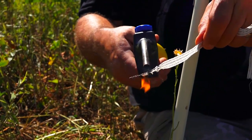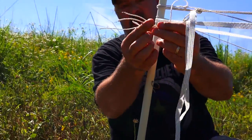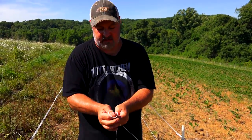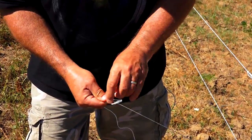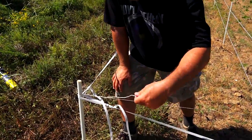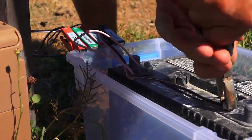We're gonna run all this together — those six wires — melt the ends just like we did at our junction halfway around the fence, and strand all six wires together. There's a clip clearly labeled 'fence' for that connection. I find it easier to take one side of the bottom wire, tie a loop in it pretty tight, and run that loop right over to my corner post. That's the end I'll melt along with the two from the tape.